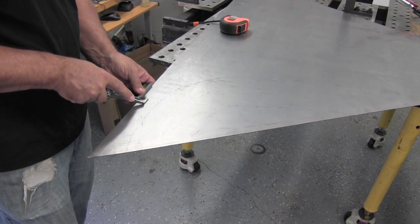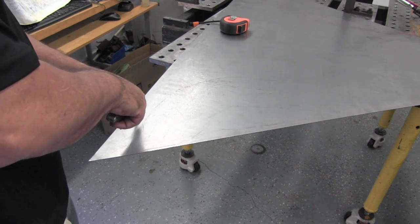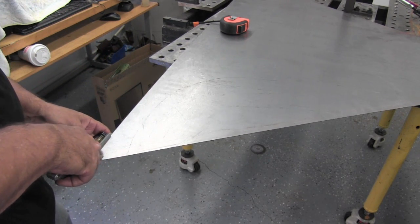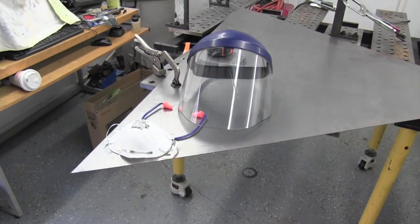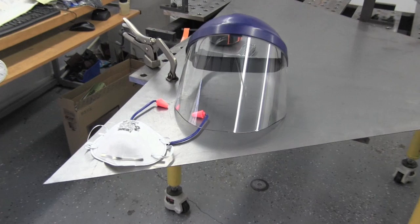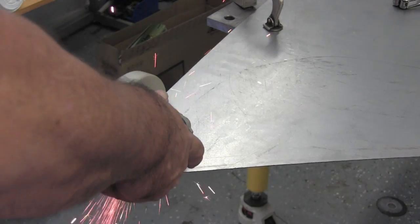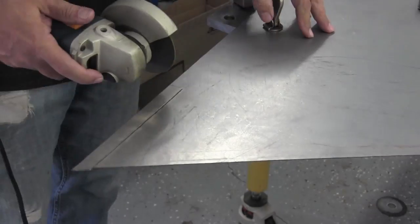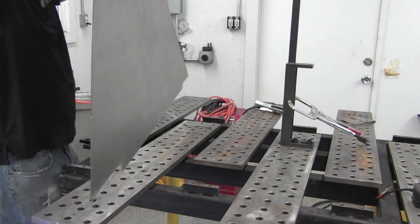I also got to cut some little reliefs in the ends here, and I'm just marking that with a pocket knife — a Leatherman tool — putting a scribe line on there because there are some bolts and stuff underneath that won't make clearance if I don't cut it. My face shield was getting all nasty, so I made a little trip to Home Depot and bought some new earplugs, mask, and face shield. Cutting those little reliefs with the four and a half inch grinder and deburring them a little bit — no problem.